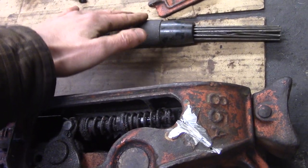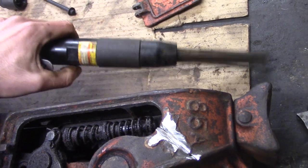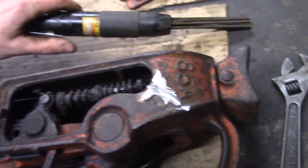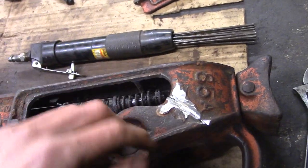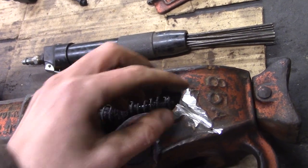And my air compressor is off and the pressure is a little bit low. I think that'll be just perfect. It'll just give a nice, soft, gentle rat-a-tat-tatting. If you don't have a needle scaler, you could use a little ball peen hammer or something. Before I ground this off, there was actually some hammer marks.